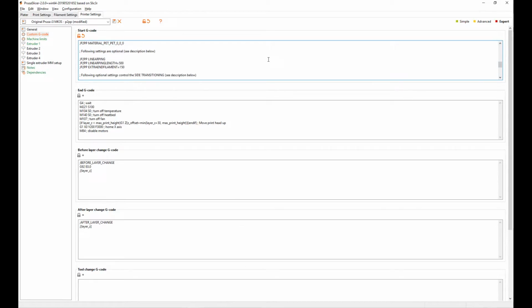Then you have the extra end filament, which tells how much filament should be left when the print is done. Basically, the distance from your nozzle to the end of the filament. To calculate this, you take the length of your hot end, plus the length of the Bowden tube, plus the length of the extruder, plus a bit more so that you have something to grab onto to pull the piece out when the print is done. If you have a direct drive extruder, you just put in the length of the entire extruder and hot end unit plus a little bit so you can grab onto it afterwards. This is to ensure that when the print is done, the Palette will cut the filament long enough that there is still some filament for the extruder to grab, and also a little bit sticking out of the extruder so that you can remove it after the print is done. So that's how you calculate this.